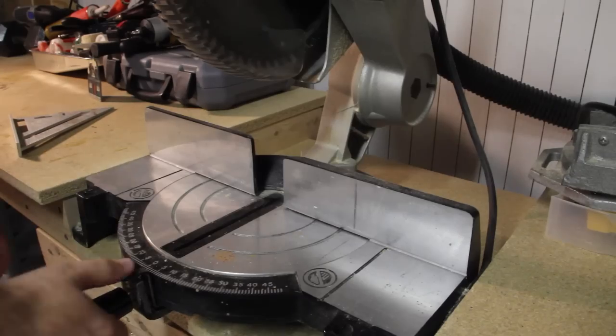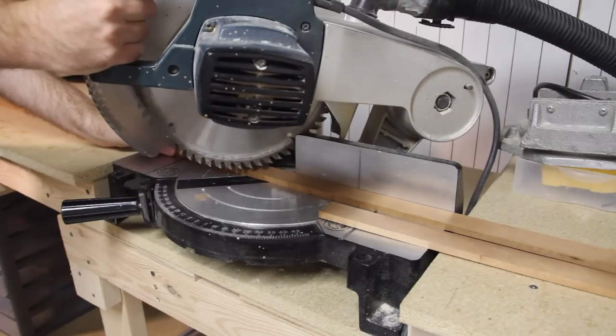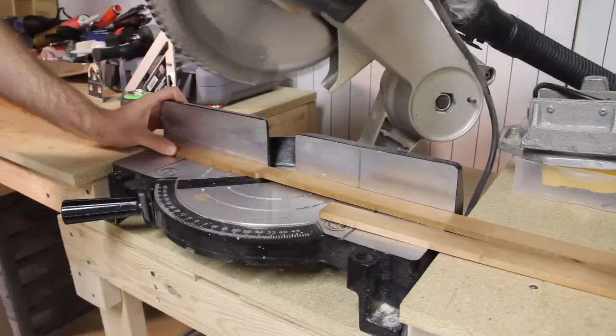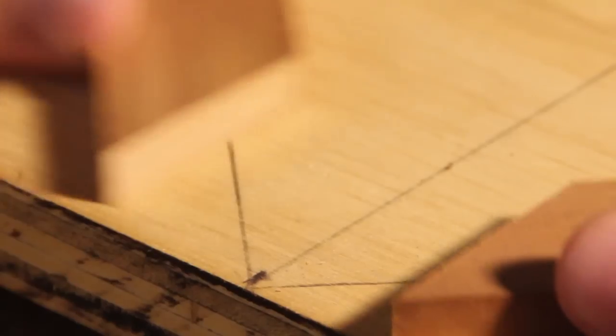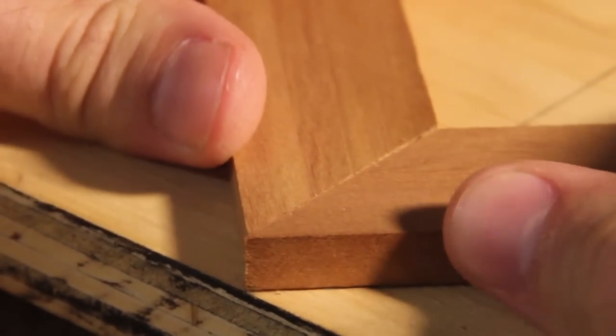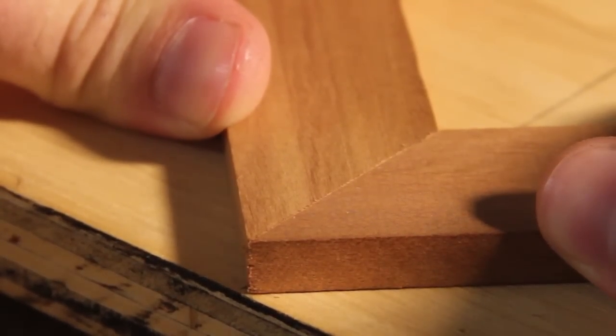This new line measures about 26 inches. I'll set up my miter saw to 45 degrees and cut two pieces slightly longer than the hypotenuse — the longest side of the triangle. The angled cuts go together at the end of the board and protrude past the other side. I want to do this for all the pieces because it's easier to trim off what I don't need rather than come up short or try to create a perfect cut each time.